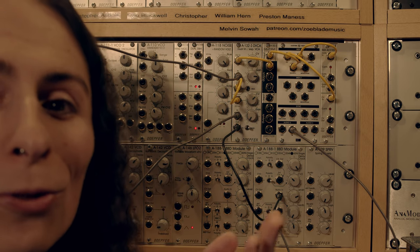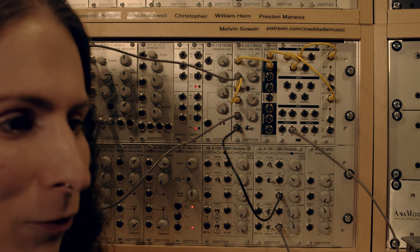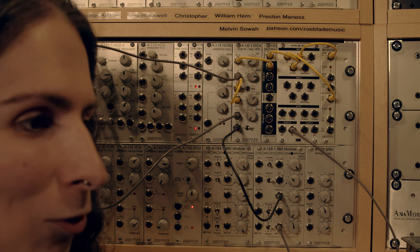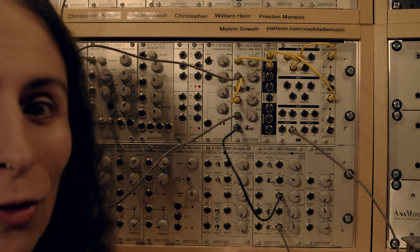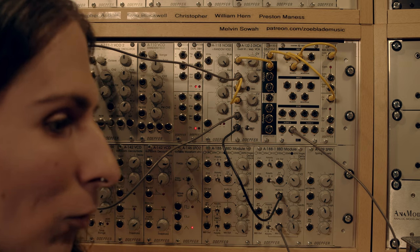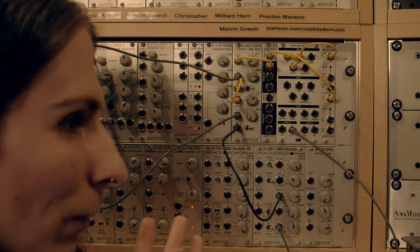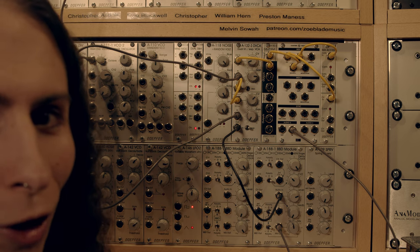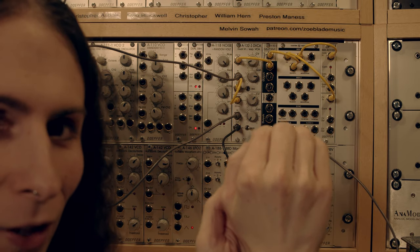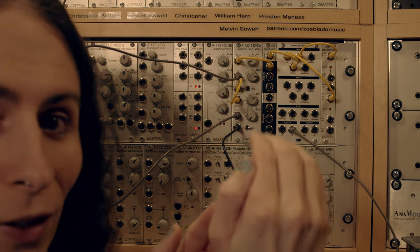Okay, so with a digital sampler, you digitize the waveform every few thousandths of a second. You will see which position the speaker's in, make a note, assign a number to that position, and you'll file it in your memory banks for later. So when you play it back, at a set frequency, say about 40,000 times a second, you'll say, where should the speaker be? Here, in this position, here's the number, we'll move it to there. Next time, where's it supposed to be now? Okay, we'll look up the number, we'll move it to there.